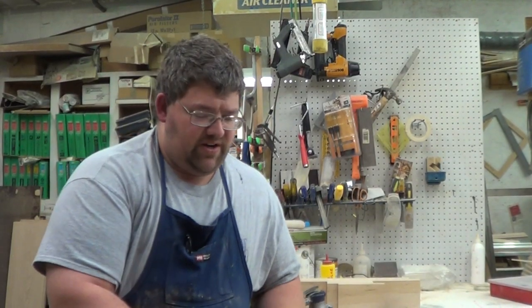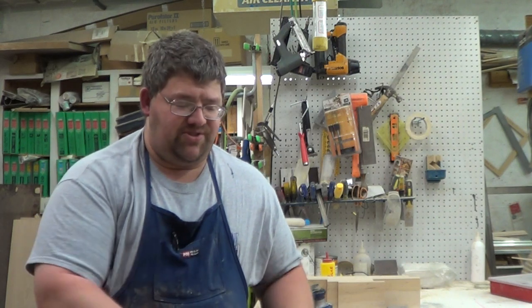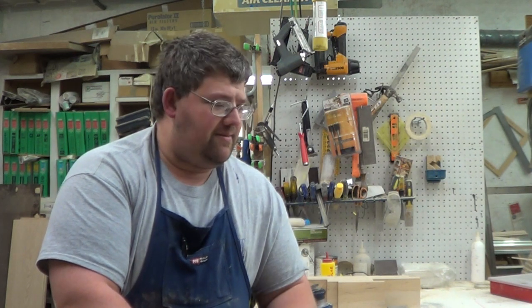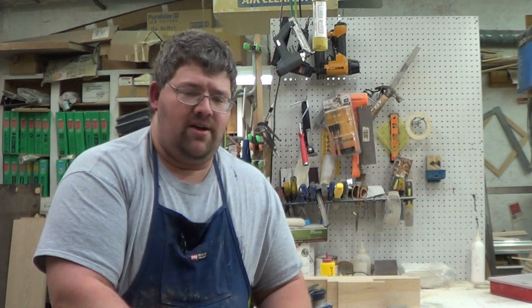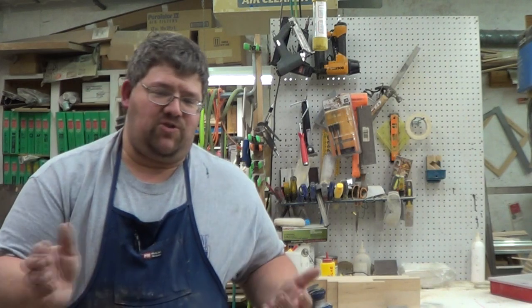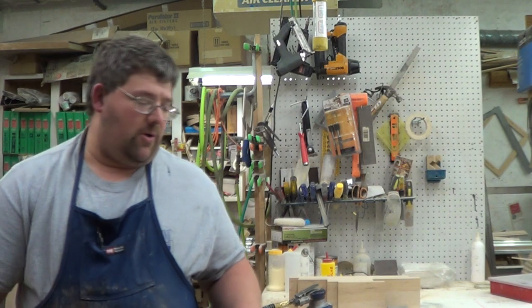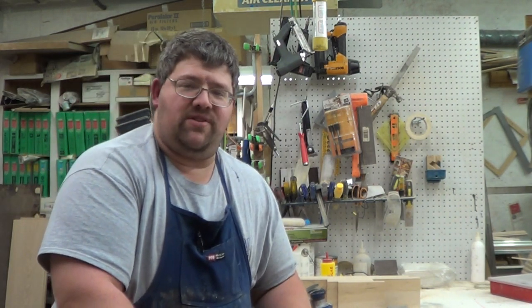In the next part of this video series, we're going to put these doors together, then machine the outside profile, sand them up, and also drill for the hinges. The hinges are a concealed hinge, a Blum 39, I think it's a 39C. Anyways, it's a Blum concealed hinge, 1.25" overlay. These doors, like I said, will finish at 8.5 by 29.5, and the opening is only 6 by 27, I believe. So that will be in the next part of this video series.